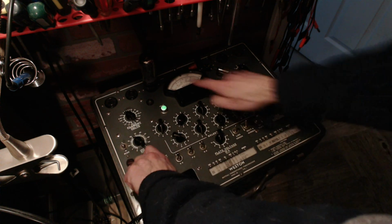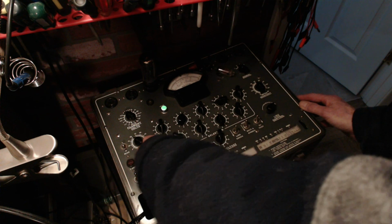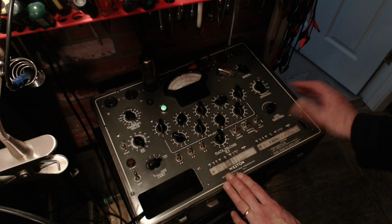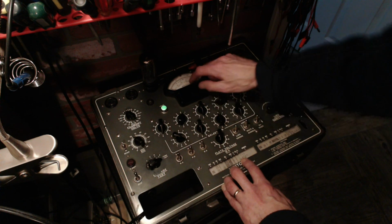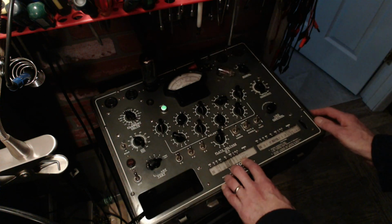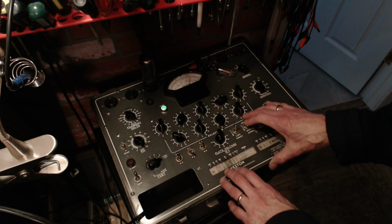Shorts. Watching the meter. There's the short on one, as the note described. This is a rectifier, so if it's okay it should come up a little past halfway. The rectifier is okay. There we go. That's one half. That's the other half. Perfectly fine too.